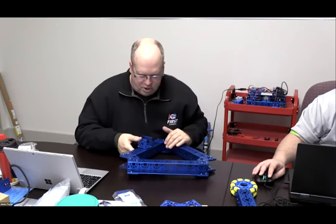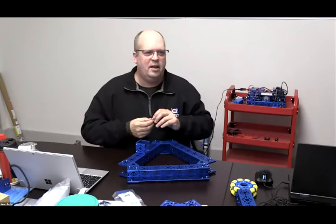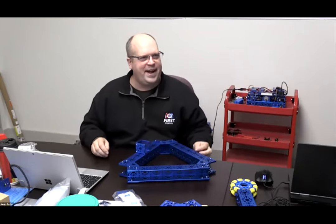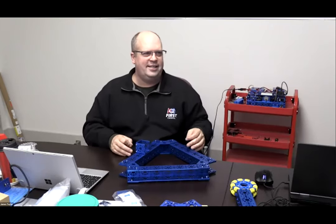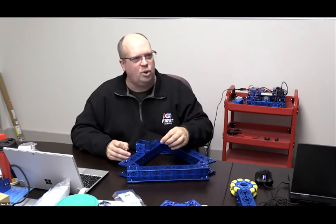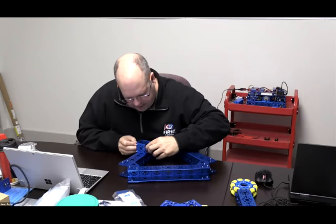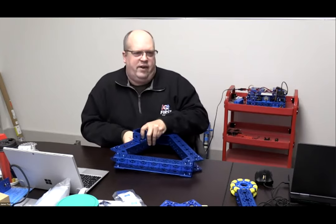Yeah, I'll tell you why I disagree with you, Ashish. I've assembled with the straight aluminum color, but this way, when I'm assembling, I can actually see the fasteners easier. And I can notice if the fasteners are loose. That's one of the reasons why we have the darker channel: that contrast actually enables me to see the holes easier. And it enables me to see if I've actually got these mounted and in what hole pattern they're in. So I actually find it a lot easier.